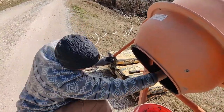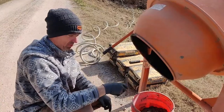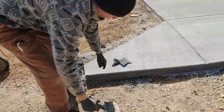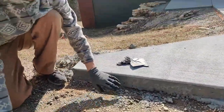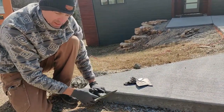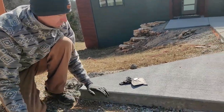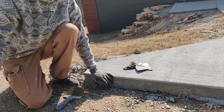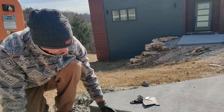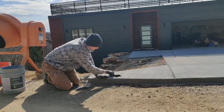We've got ourselves some bags of Quikrete. We have the edge of our concrete — I want to be able to drive up on it without chipping it. The road has a slope towards us, and I don't want water from the road making it onto the driveway. That's why I set this up on top instead of digging the dirt out and making it flush. So what we're going to do is make a ramp.